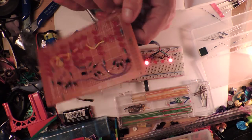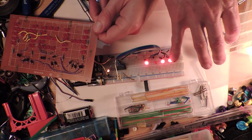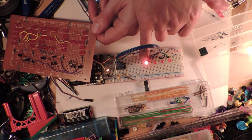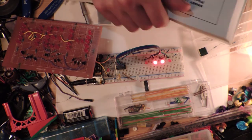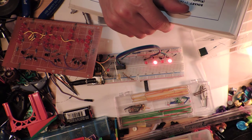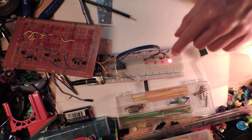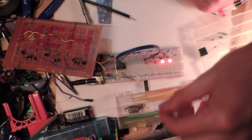Yeah. So for this thing here, I could have a switch and I could actually clock the 4017 off one of these inputs, and then I had a little switch, the two-way switch things. And I could switch between either clocking it off, say, this, or clocking it off this one. But I think somewhere it says in this thing, it doesn't make a very good clock. Okay, maybe it doesn't. Well, it's using itself as a clock, so obviously it has to be a reasonably good clock pin. What I mean is that maybe the output from these things, because it's a ripple counter or something, isn't quite conditioned enough to be used as a clock.